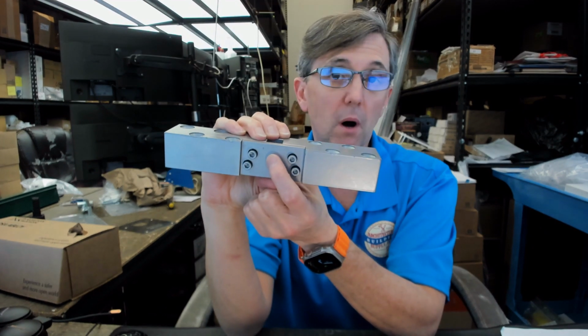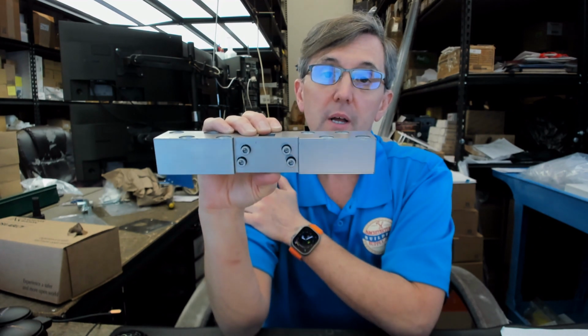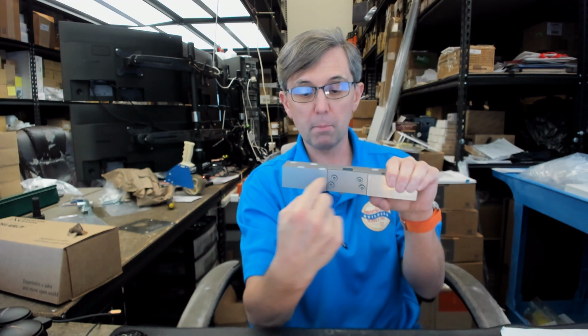And then it's a wood door, so what will happen is you will literally make a removable panel out of a patch of wood. You'll carefully cut that out, and that will become a removable panel that will go over this. And what you might end up doing is using a small amount of hook and loop tape, Velcro, to get that on there. Generally, when it's aluminum storefront, there'll literally be a piece of 30 thousandths or 60 thousandths aluminum put right over that with a couple of screws. And that does tell someone, that's the service point. That's where I can get to the arm. It's generally overhead concealed closers, but the concept is the same, end load or side load.